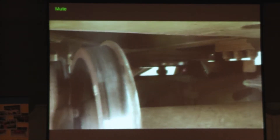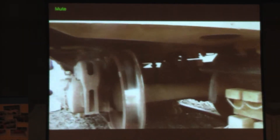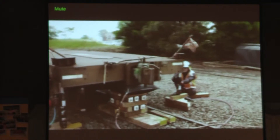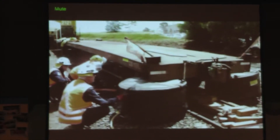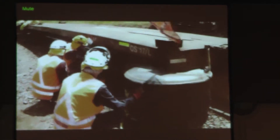When you do that, you are able to lift the bogie — it is a good shot of it there with the kingpin exposed, showing how much space you would be able to achieve to get the patient out. As in the rescue that Steve was telling you about, they only needed to release the brakes, which created about a 10-millimetre gap, and that additional 10 millimetres was what allowed them to get their patient out. In training, we always try for approximately 100 millimetres of lift — if you lift 100 millimetres in training, you should be able to manage any real incident. Train harder than you would expect to work at an actual incident.